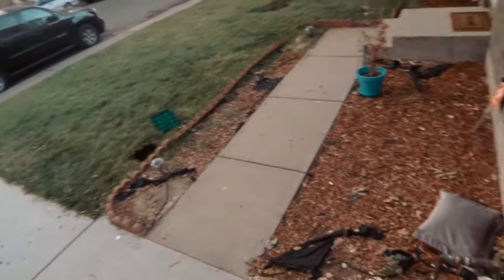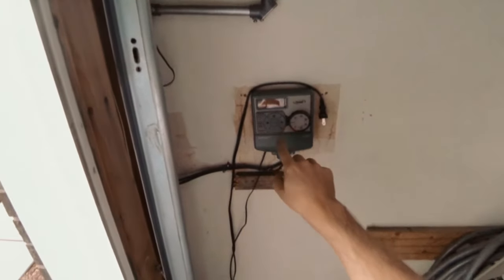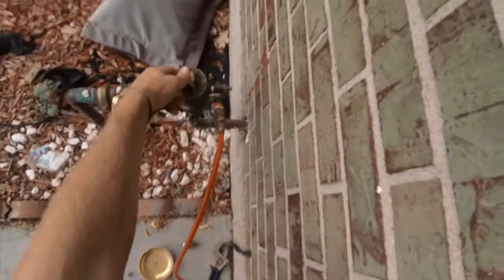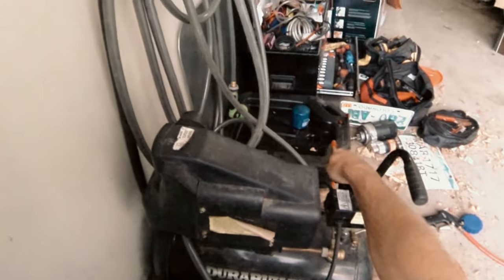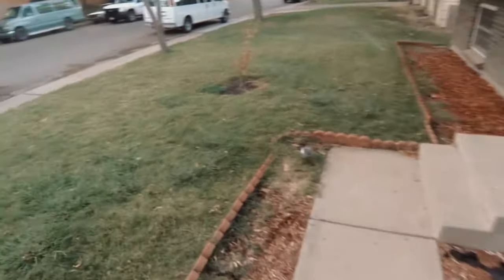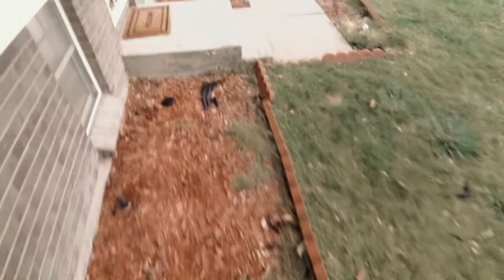Pressure is back full. We're done with zone four, moving to zone five. Zone five is on now — still all hooked up. I'm going to hold this up with my hand, open the valve, and turn it on. Zone five is blowing — still a lot of water in the lines but we're getting it. Pretty much just air now. These are all blown out — go shut off the valve and save that last bit of air.